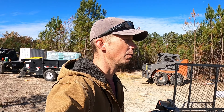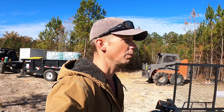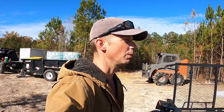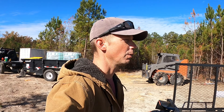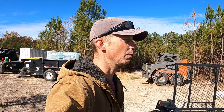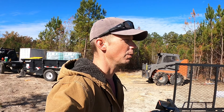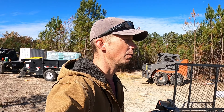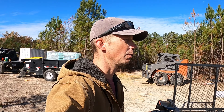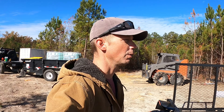We're going to try and see if the skid steer can lift these off. They're a little beyond the lift capacity of the skid steer but it's a monster — a 2005 Thomas T175, rated at about 1,750 pounds, but I've lifted 2,000 pounds with it multiple times and it doesn't care. If anything it's tippy to the rear with nothing on the forks. Let's get these tanks unhooked and strapped down and then get the first one off and set it on this trailer.